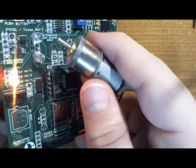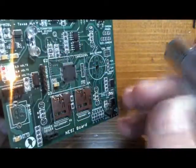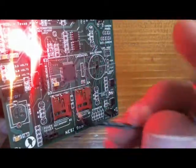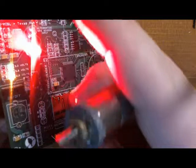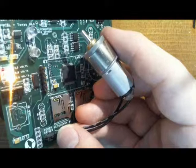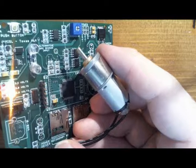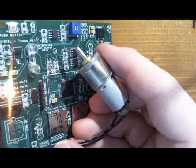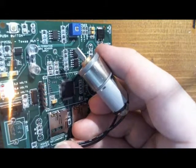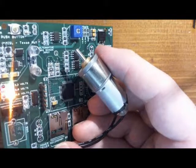You can see that our program works because the motor is actually running here, and if we were to unplug it, that red LED will turn on. And then as soon as we plug this back in, it'll start running again, and then after it's finished its cycle, that red LED will turn off. Note that the is okay and is failure functions actually end up turning off power driver A. So if you're going to use those, just make sure that they don't interrupt the flow of your program. So if for example you have power driver A dot on followed by if power driver A dot is failure, it will turn the power driver A right back off. So just make sure you take note of that.